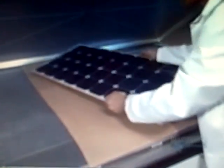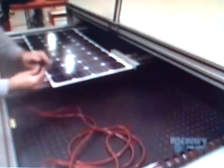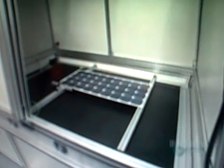Here's the finished panel — all the components are bonded together. They now proceed with the test. The panel is placed in a solar simulator. Negative and positive contacts of the solar panel are connected to a voltmeter. The panel is inserted into the simulator and a powerful lamp will illuminate it. The voltmeter is read to make sure the panel supplies the electric current required.